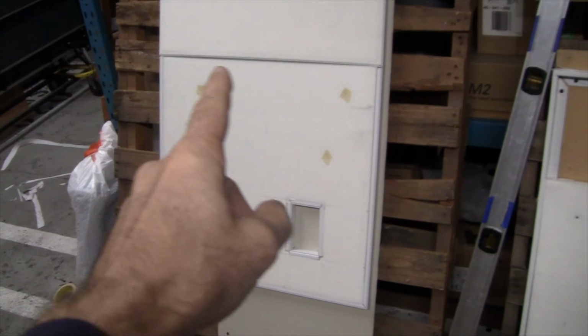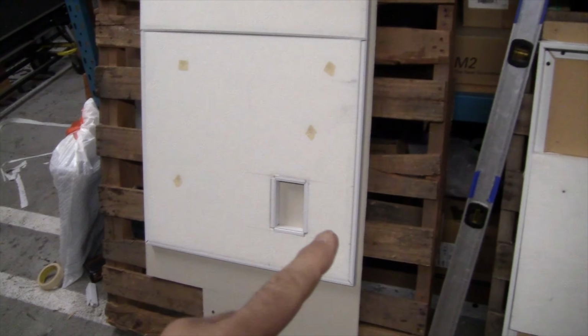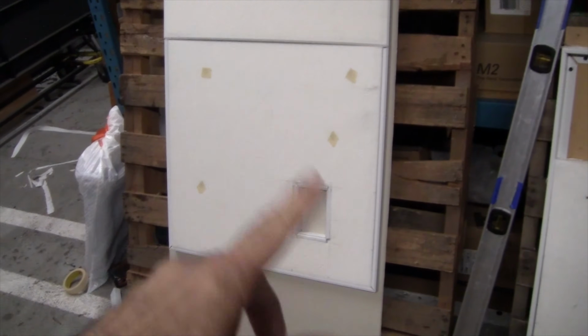Okay, I'm getting ready to put the fabric over this piece here. I measured it out and I need a piece that's 28 by 26, which gives me about 1.5 inches overlap all the way around. So I'm gonna work over here in this section, so I took a moving blanket, put it on the ground to try to keep the fabric as clean as possible.